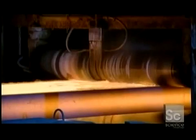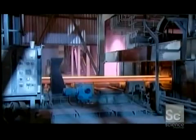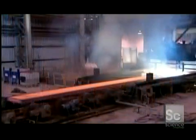The bubbling steel soup now flows out of the refining furnace. Rollers guide it as it's cast into a long mold. The result is a 75-yard-long ribbon of steel. Torches cut it into shorter chunks called slabs.